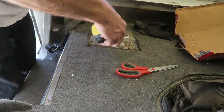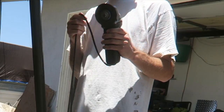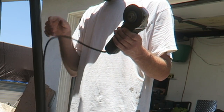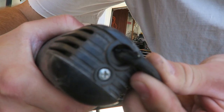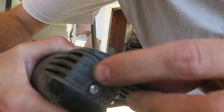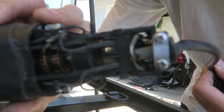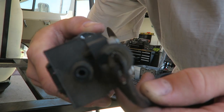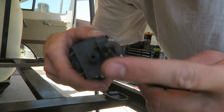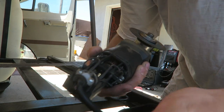The carpet is cut too professional, dude. Sparks started flying when I turned this thing on, and you can see right there it's all burnt and it's all hot. Wire melted too - must be a short or something. There's just one screw hole in this rear section of this cut-off wheel or grinder. I took it off and I can see where the wire is jacked at right there. I'm going to go ahead and cut off this wire and re-solder on some new points to it and we'll get her all back up and running again.